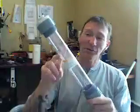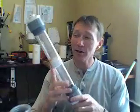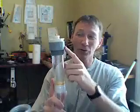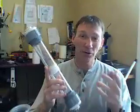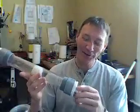But what I'm changing this out to, ordered with McMaster-Carr, I think it was McMaster-Carr, is clear PVC, 2-inch PVC Schedule 40. So that way, instead of having to use electrical plastic parts and kind of jerry-rig all this stuff, we'll be able to use the 2-inch PVC parts from a home improvement store, and that'll give us a greater range of parts that we can use. And actually put end caps, just put a cap on there and then just put the nylon connector with the marine Loctite, marine epoxy, and we'll be rocking and rolling.